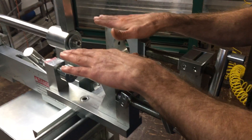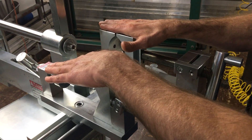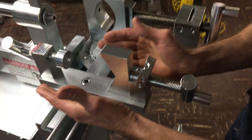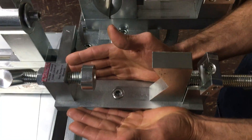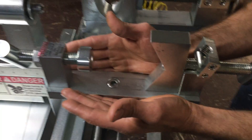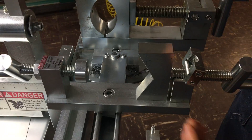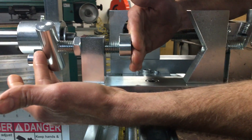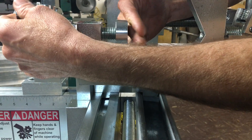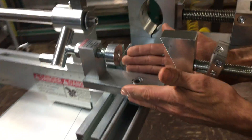Getting to the main portion of the machine where all the cutting is going on, we are using multiple clamping or tandem clamping. So we're keeping things very secure and very tight. We're going to go over the support vise. The support vise is a necessary feature when you're making a cope-to-cope type of cut. We're able to clamp it quickly with the quick release portion of the vise. You've got the speed handle right here and you can give that inside support, adjusting to the right size tube you're working on. If you're not working on a four inch, you can adjust it quickly and then maintain it with the jam nut. A definite must if you're doing cope to cope.